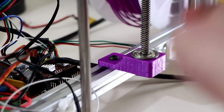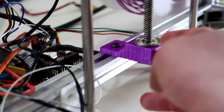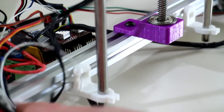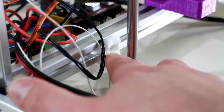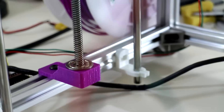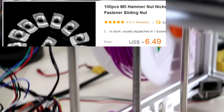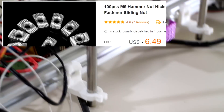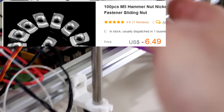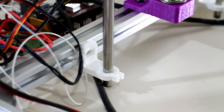The whole build platform and lead screw is now resting on a bearing attached to this block. You may have noticed on the linear guide rail clamps, I haven't populated the button head screw and T-slot nut into any of them — that one, that one over there, the ones at the top — because I've run out of T-slot nuts. I've used the entire bag of 100 T-slot nuts and I need more, which I think will also be contributing to any small issues on the Z axis.